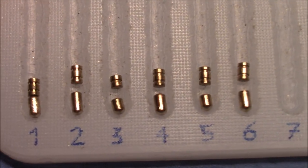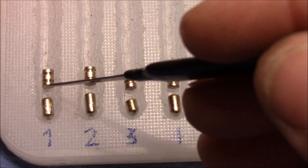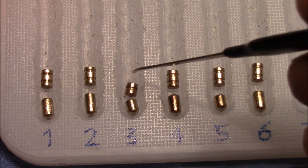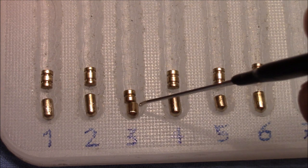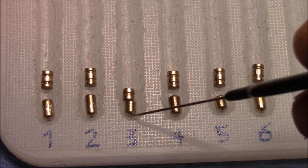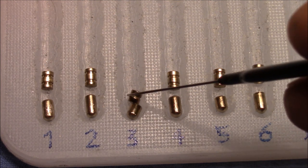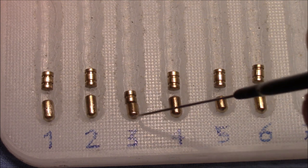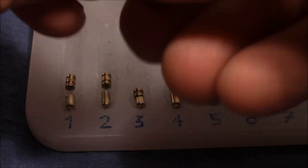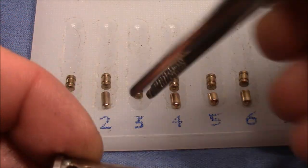So here is the pin situation. We can see the drivers are all double serrated beside of 3, and that's actually really funny because 3 has a very short key pin, and I don't know why they put an extra short driver in that stack, because if you reassemble the plug you will see that 3 is actually below the shear line.